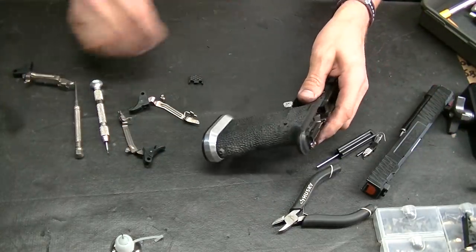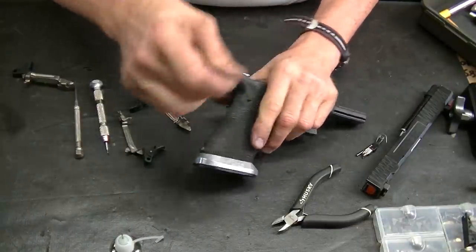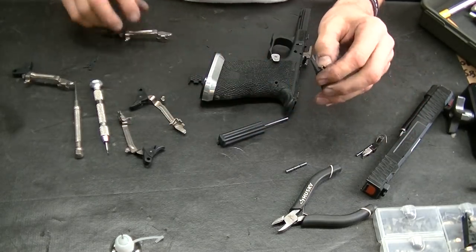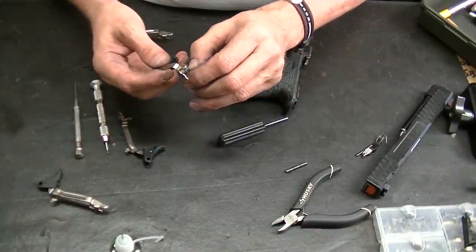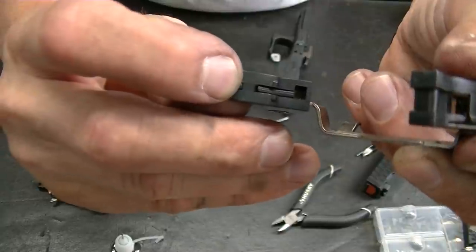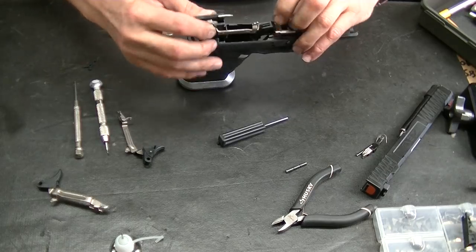I like what it's feeling like, and I've really spent some time with the bar to get it to behave like I want it to. So with that said, I'm going to try my best to keep this bar. If I put another bar in real quickly — here's the gen three bar we had, here's another gen four bar. The trigger safeties are modified on these, and I know exactly where to cut on this tab to get it to work — gen threes and gen fours have different cuts. We're going to drop this in and see how it functions.